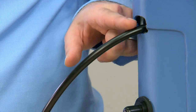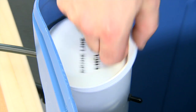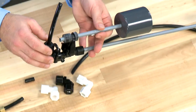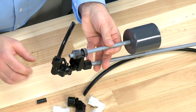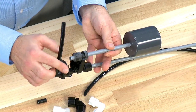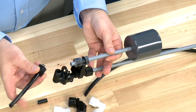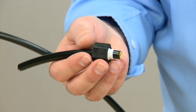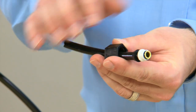We then follow the tube into the brine tank and find our way into the valve assembly. Inside the tube assembly, we can follow our hose and find our connection points. These connections are normally done with plastic fittings to make sure that there is no corrosion from the salt that is in the tank. As we remove this hose, we again check to make sure that there is no scoring in the ends of the hose.